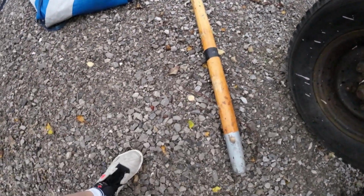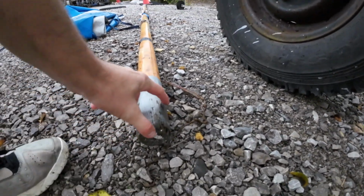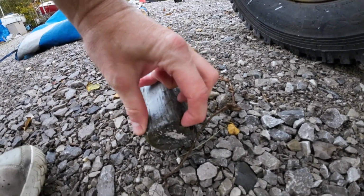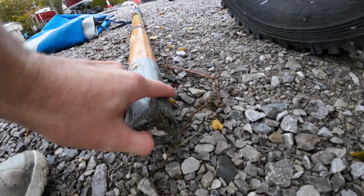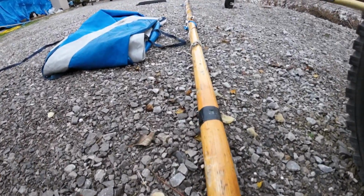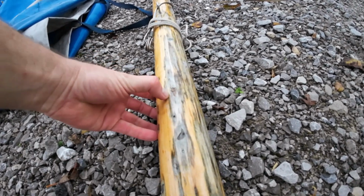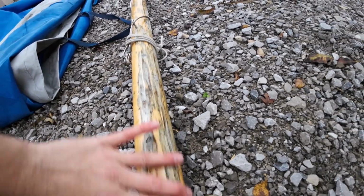Here's the mast, the main mast. So there's a few problems with this. First of all, this bottom here, you can see it's just gone very soft. This silver paint's not really lasted. So this bottom's gonna need some attention. The other thing is, this is where the varnish is worn off or water's got on the varnish. So this is all gonna have to come off.